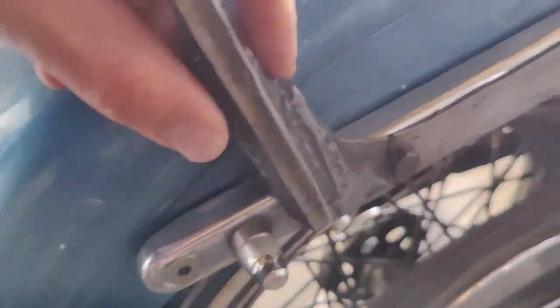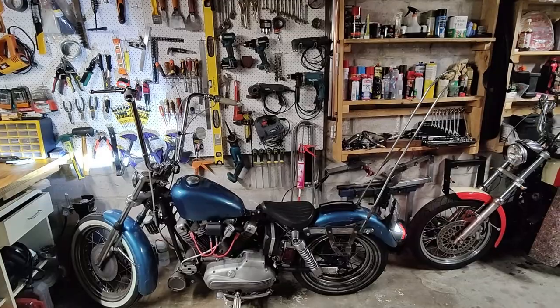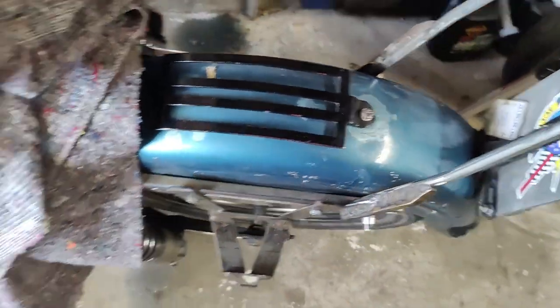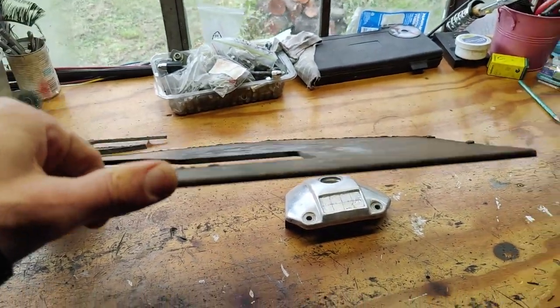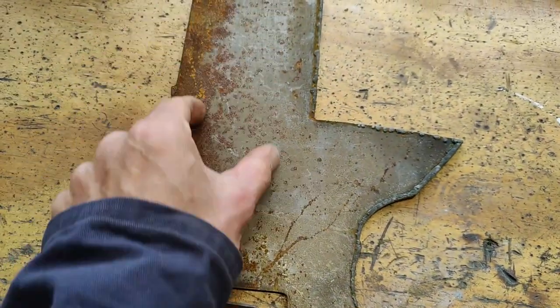My plan is to take this all off, cut the brackets off — because it was only 3mm steel — cut a 5mm hole in there. I have from local engineers a scrap of metal, it's 5mm steel, and I'm gonna cut a bracket from here and hopefully another bracket from here. I don't have any plasma cutter or anything fancy, it's gonna be just good old hand grinding. Let's get to it.